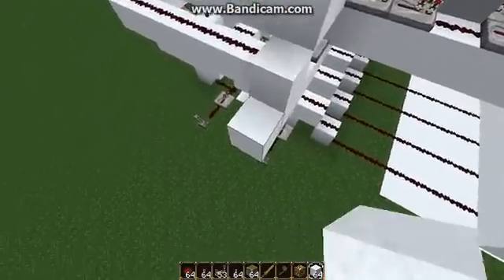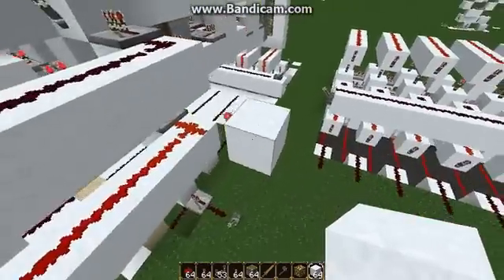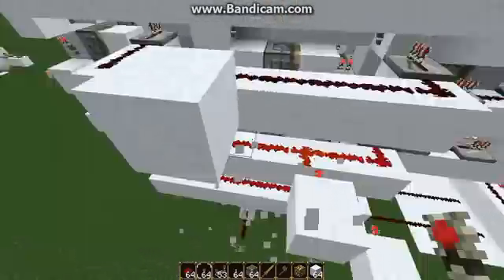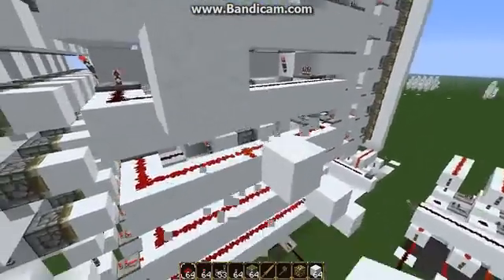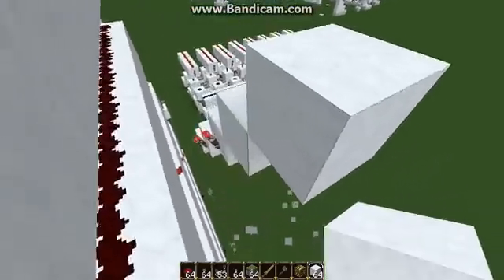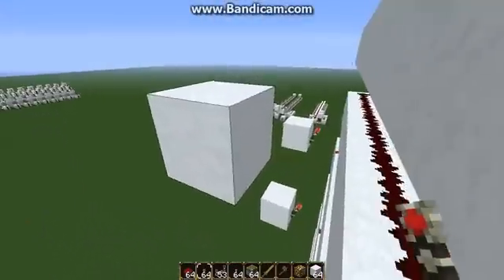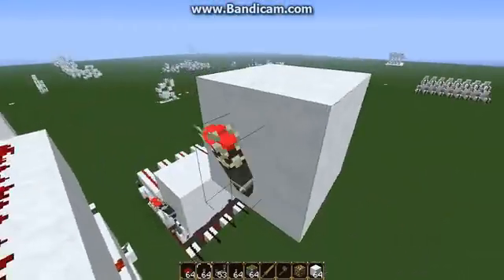This is going to require us to do a couple of things. First off, we're going to want an inverter in front of every single one of these. I'm a little sick today so I'm not thinking properly, so I'll apologize for that right off the bat. The reason is because whenever this wire is powered, it's going to disable the writing to the layer. The Y command is going to control which layer is being written to and which one isn't.